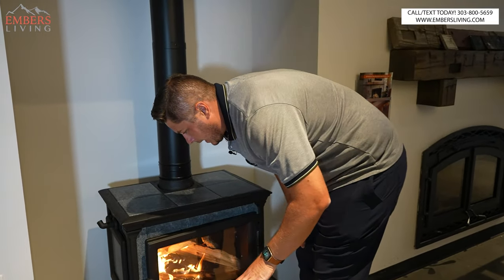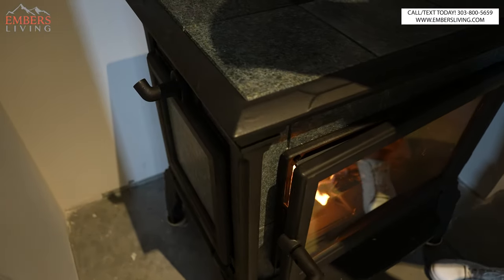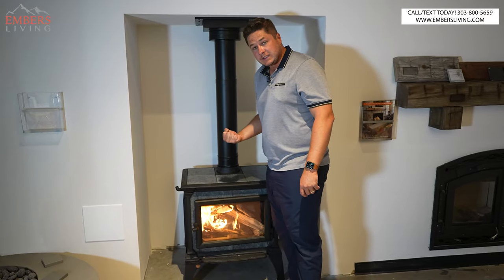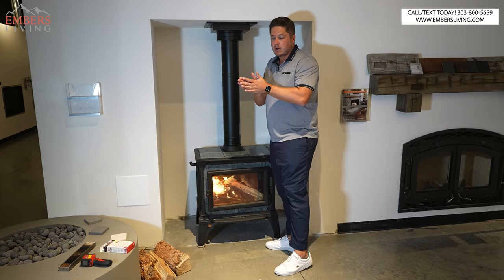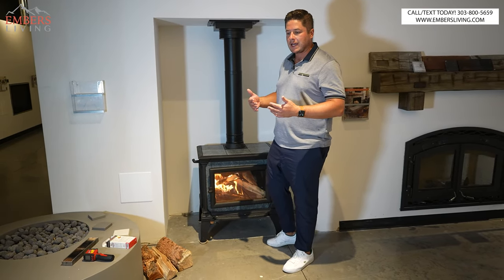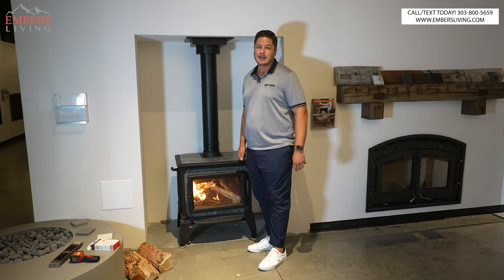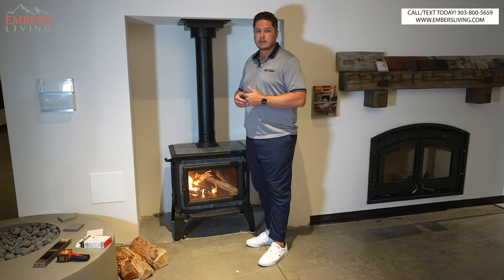Okay, this is what I'm looking for guys — I told you we had to be patient with it. Look at that — this sucker has finally established a good enough draft that it's pulling so hard it's wanting to suck that door shut. That means we're getting close. Once that door wants to suck itself shut, it would be really, really hard to smoke out the room. I still like to wait because by being patient on the front side, you get more heat on the back side. You can't just put fire starters in there, squirt fire gel on, put eight logs in and light a match — that's going to cause problems. It's a little bit of a process, but you just sort of learn it — you have to learn your stove.